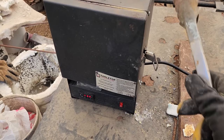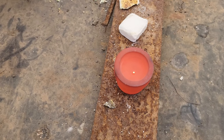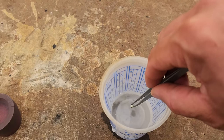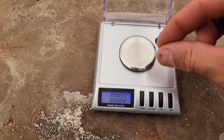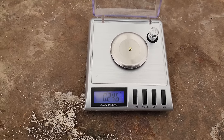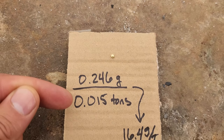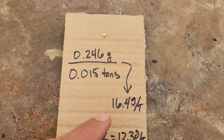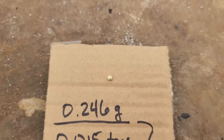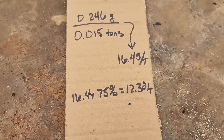Let's check on our bead here — oh, that's a nice little bead. Yeah, that's pretty good size. Nice little gold bead — let's get this thing weighed. It weighs about a quarter of a gram. That's pretty good. I think Dan said it was about 30 pounds of ore. So now let's do some math to figure out how much gold he has. The bead weighs 0.246 grams, and 30 pounds is 0.015 tons. When you divide those two you get 16.4 grams per ton. But based on the color of that bead it's not real, real yellow — we'll estimate just for fun that it's about 75% gold. So 16.4 grams times 75% gold is 12.3 grams per ton. Not too bad, Dan — good work.